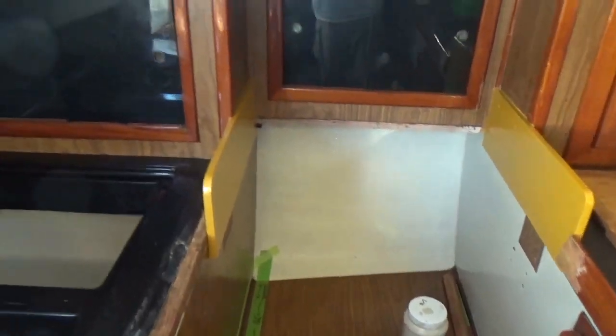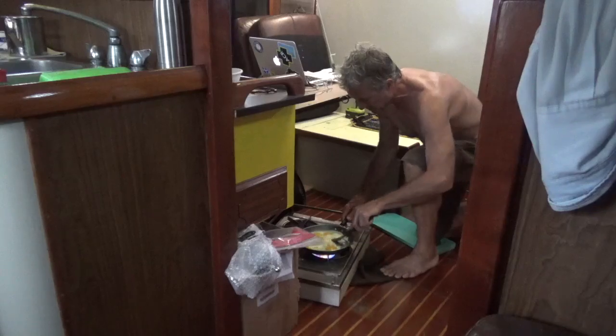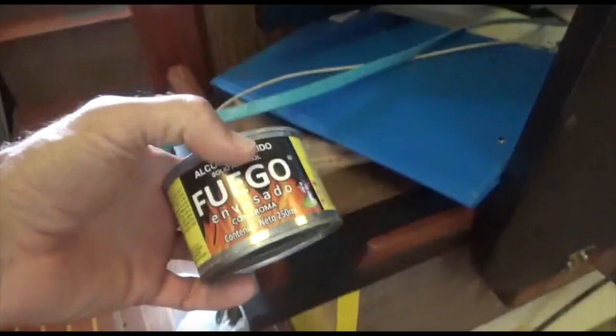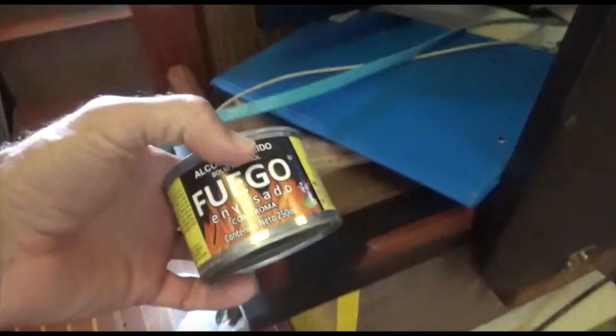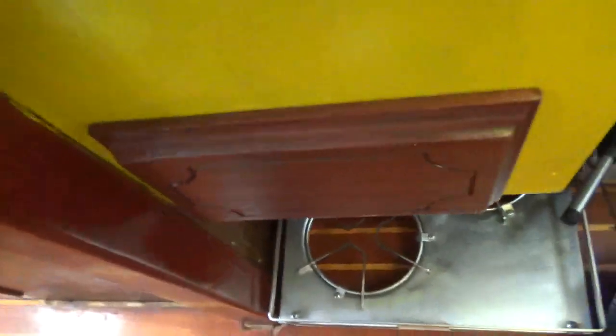This is the old galley and this has been my focus. It was an old double fridge area, and I showed you last week some of the construction work I did to get out of cooking on the floor with a contrivance made from a salvaged stovetop and liquid or solid alcohol fuel underneath. I've got a bunch of plywood and about seven layers of fiberglass cloth, a lot of epoxy, and fairing material to get it smooth.